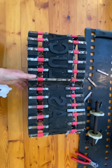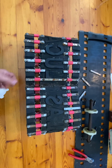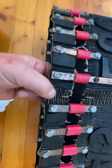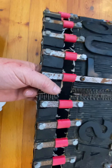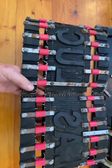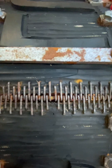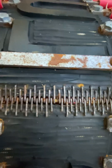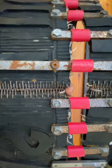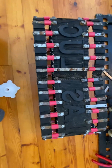I'm going to take it apart and show you what the ends look like. This has been about 20 years since I built this. It's got one-eighth inch 6013 welding rod with the flux knocked off it, and the ends have to be bent over 180 degrees and folded back onto itself. Because you've got a bogey wheel running there, it will break in the middle — and you can see that it has. Whenever it broke, it lost one piece of the staple. The lacing is gone; a couple of pieces have ripped off. It's a tough old track.